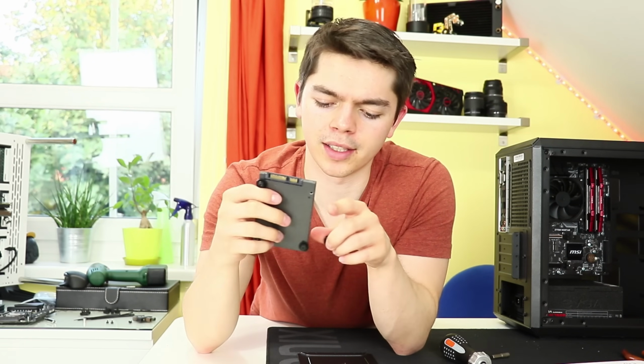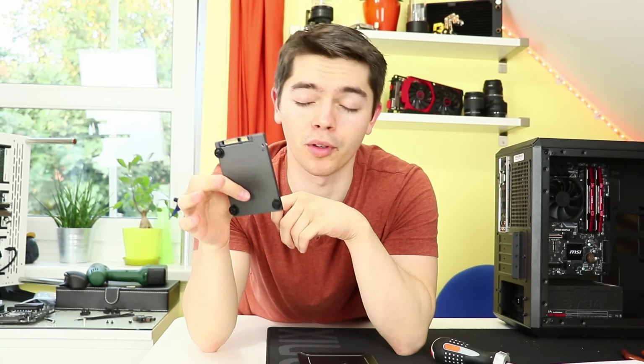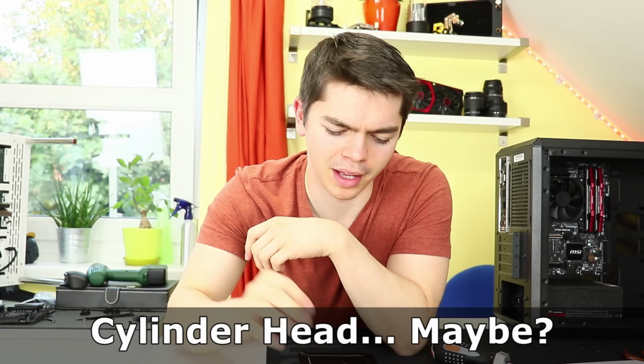You may have noticed that I counter screw before I screw in on a lot of occasions. That's so you don't do that, but on one occasion I just tried to rush it, and the one time I didn't do it, it destroyed the thread. So especially when you're working with steel screws in an aluminium case, you really want to be careful about the aluminium. It's like spark plugs in an engine. Always counter screw and then screw in, because the steel will just destroy the thread of the engine block. I'm not an engine person, but I just know that's a thing.